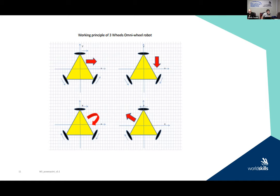So there's no question. You have to understand the working principles of an omni-wheel drive robot, and you should think about this. We're going to talk a little bit later when we talk about mounting, as an example, the VMX, and we talk about the IMU, and what is the zero yaw direction on the IMU, or the integrated motion unit, when it is mounted. You have to understand that, so we're going to cover that for you, because with the old IMU, we did have an axis mounted on it, and you could see that default axis. And now with the VMX, you don't, so you have to understand which way front is, and that's going to affect the mounting and how you're going to orient the integrated motion unit.